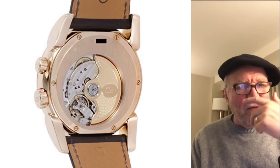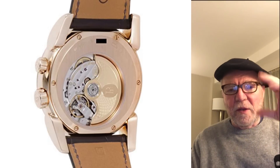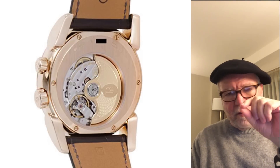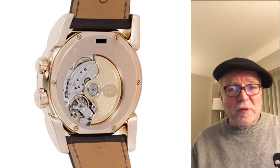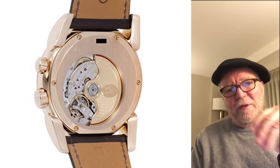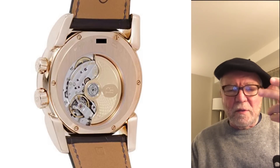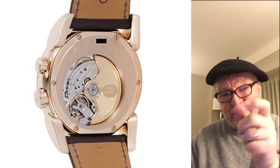Why don't they say they'd rather have a little more stability? Well, there are all these trade-offs going on. When you have a larger wheel, you need more power to kick it around, which means a bigger mainspring. The better the balance, the easier it is to swing around. When you have a larger balance wheel and add weights to the end of it, you've got a huge amount of stability. One way to maintain accuracy with a smaller balance wheel is to increase the speed — on watches with a higher frequency, you can get away with a smaller balance wheel. They're making more semi-oscillations than one with a bigger wheel.